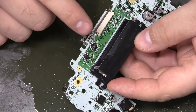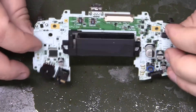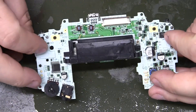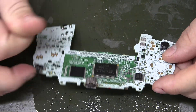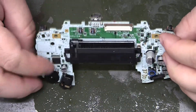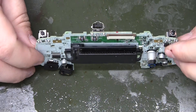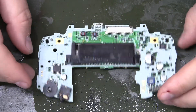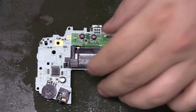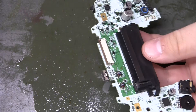This is where I'll be using the double credit card and bed sheet to clean the contacts. Something to look at when buying these: if you see corrosion on the battery contacts, there's possible corrosion on the cart connector too — and even though it's through-hole, that's going to be a huge pain to replace. I'd just avoid it if you can. I doubt many sellers will tell you the truth about corroded pins, but I buy these in bulk so I have spares and plenty to choose from.